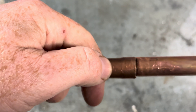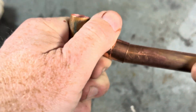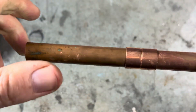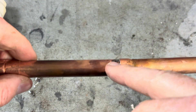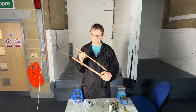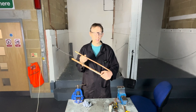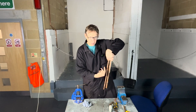Expanding the end of the pipe enables you to connect another piece of pipe to it. If you never had an expanding tool you'd have to use a fitting like this — a coupling, a 15mm coupling — so two solder joints, whereas the expanded one has only got one. So now you know how to use a pipe expander; it's your turn to make one out of 15mm and 22mm to the specifications on the diagram, and also to give you a challenge, solder it upside down.